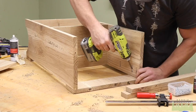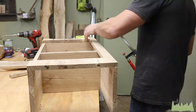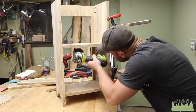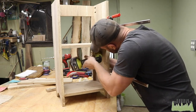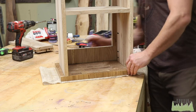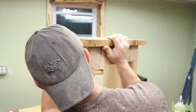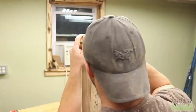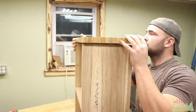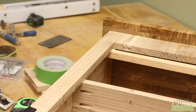You might need to do a little bit of clamping — mine was actually really good. Oak is easy to work with, especially if it's true; it just doesn't bend too much. Apply some more Star Bond adhesive and add your door sides — you can screw them in. Just repeat both sides: glue, clamp, screw. For the top, lay the cabinet onto your tabletop, trace your lines, then attach using pocket holes, or biscuits if it's end grain like I did.